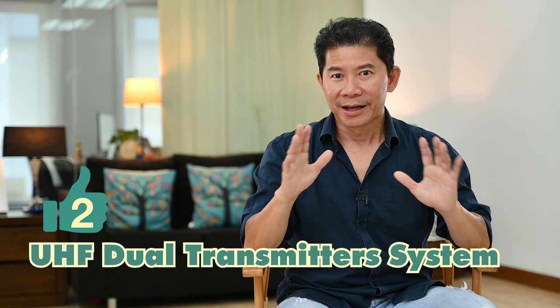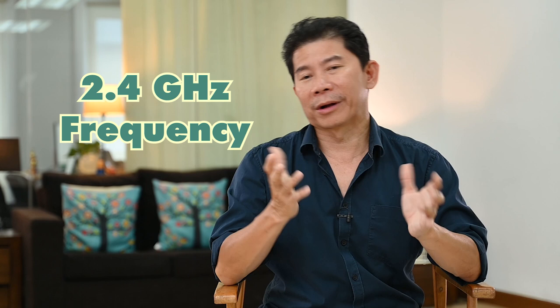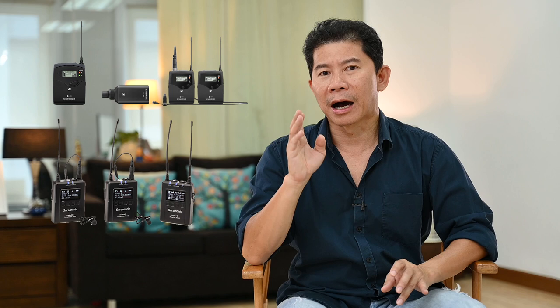It's a UHF frequency transmitter-receiver system. These days when you go online to buy a wireless microphone, more often than not you'll end up with a 2.4 gigahertz frequency — and that's really crowded. History has a funny way of going full circle: back then most microphones used UHF, then it got crowded and they moved to 2.4 gigahertz digital. Now everybody is using 2.4 GHz — your dashcam, Wi-Fi, wireless access point, and microphone — and when you go outdoors you get cut-off audio signals.